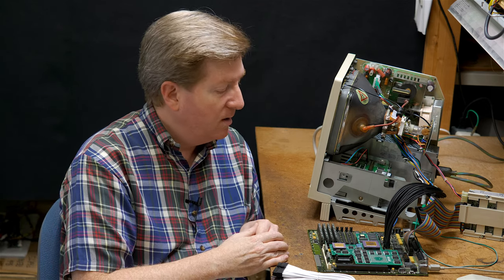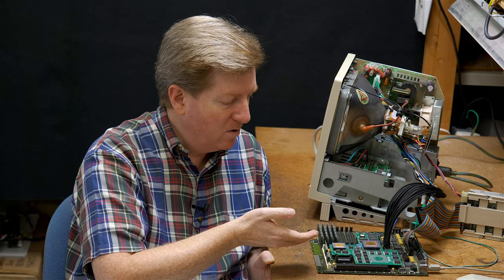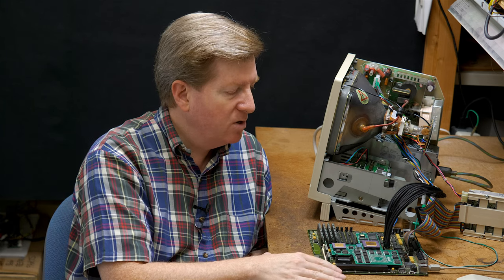That's really the tip for today on how to tinker on your board. A little disclaimer: as you can see, this desk is wooden — it's not a conductive surface, and that is extremely important. You don't want to do anything like this on a metal desk or anything where there's metal that could short out the board. I would highly recommend a wooden desk above anything else.